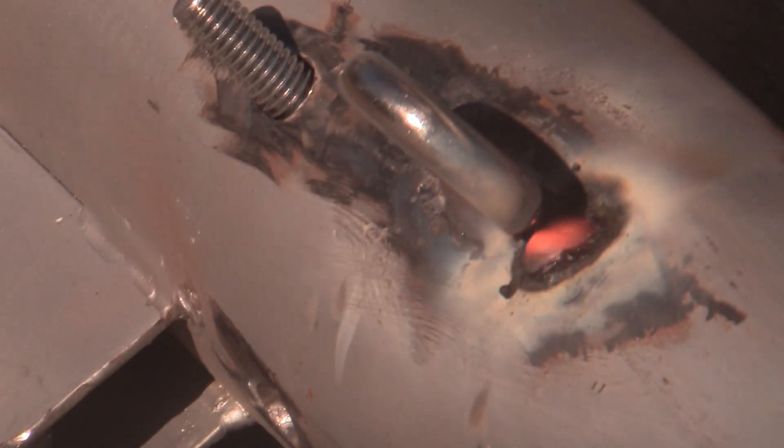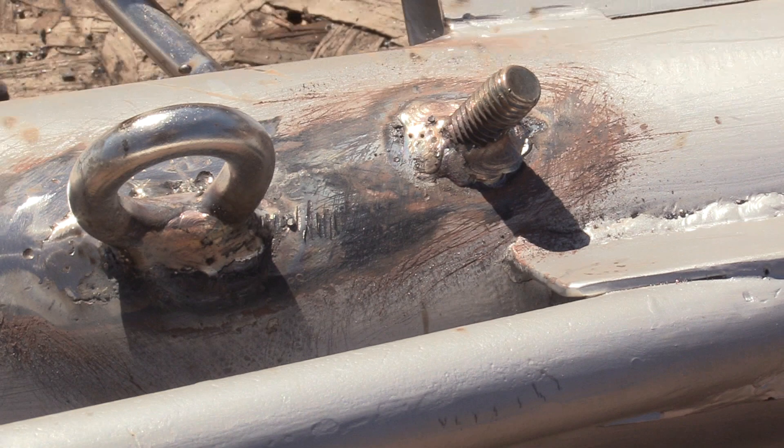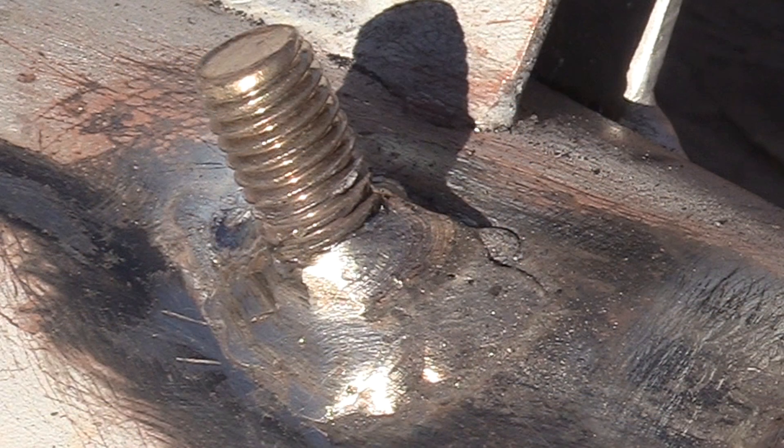When I was finished, I looked and noticed there was actually a crack along this weld on one side. That's because I didn't have these parts preheated — I should have heated them up to 400–500 degrees before welding. That's specifically for that gusset piece where the metal pieces are being trapped and restricted, making it more likely for a crack to happen there. Whereas the more open parts have less danger of cracking. To deal with the crack, I can grind out the cracked area, preheat it, and do another weld there.